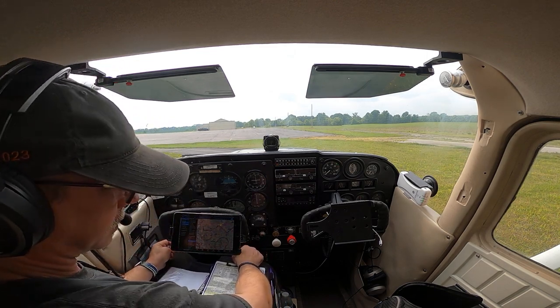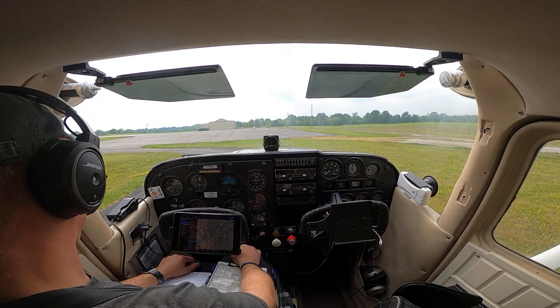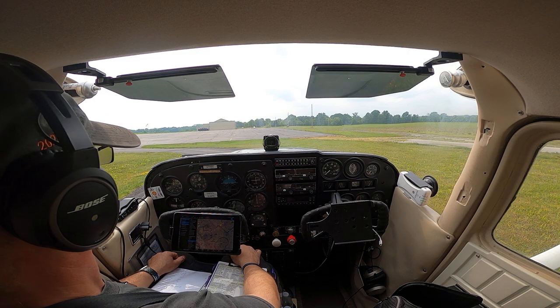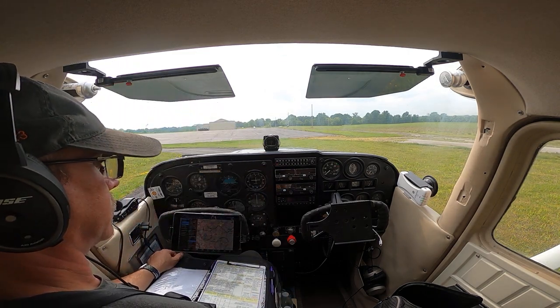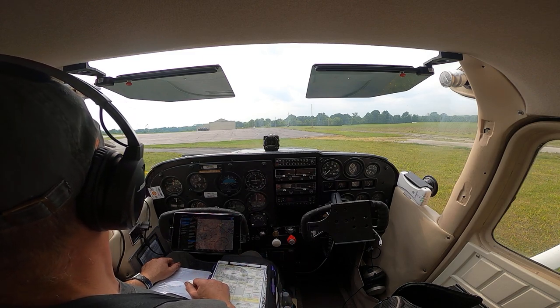There's a fire extinguisher in between both of our seats here in the inadvertent event of an airplane or engine fire. It is a type BC, so it will be applicable to handle anything that we need to handle on the aircraft. And the way that fire extinguisher works, you would just unclip it from the center of the console here and pull the pin out, aim at the base of the fire, squeeze the trigger, and sweep side to side at the base of the fire.